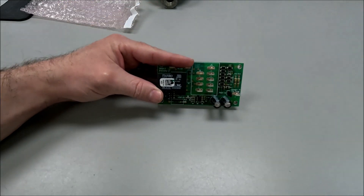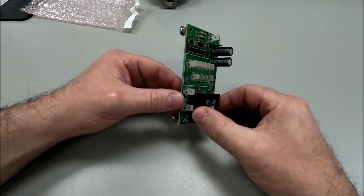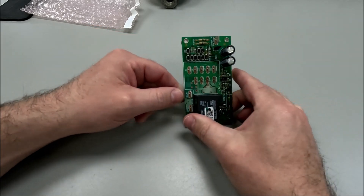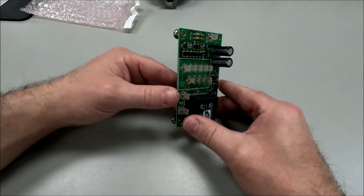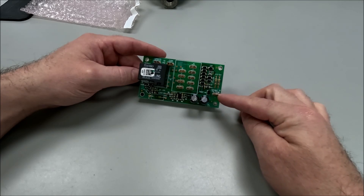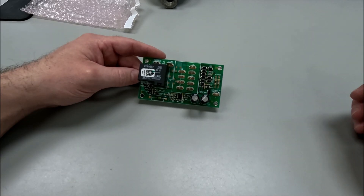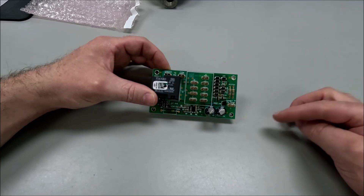Everything for your PSC motor is right here — you've only got a single speed tap, no dummy terminals for unused speeds, but that's no big deal with zip ties and electrical tape. For the rest of it, we have the five low-voltage connections as quarter-inch male terminals with a common at the corner, and your L1, L2, and ground as three-sixteenths connections — basically plug and play. There's also a little test jumper and a terminal for 24-volt constant power — your R connection — for setting off-delay timings, though I'm not really worried about that.